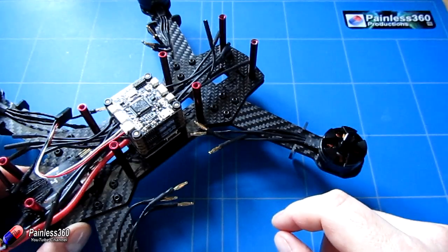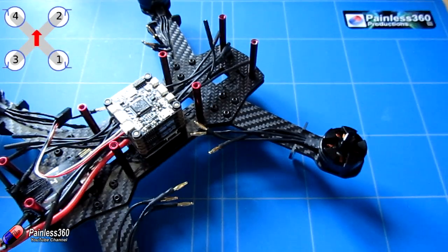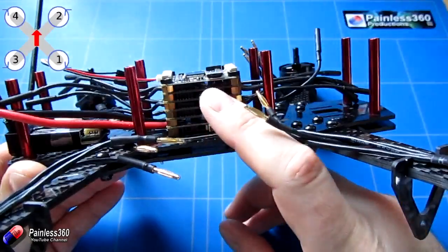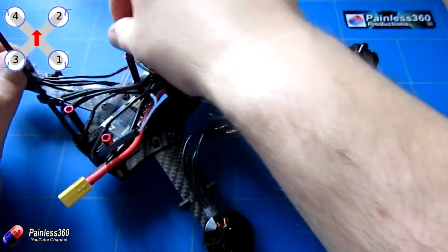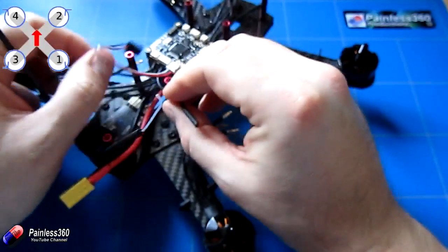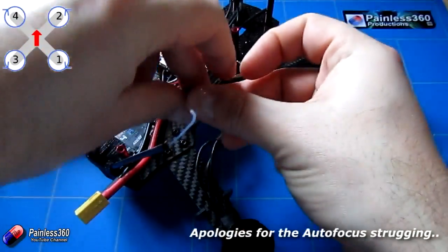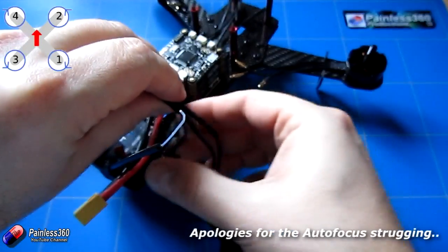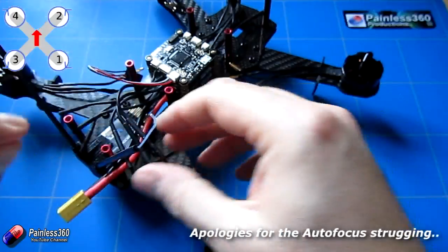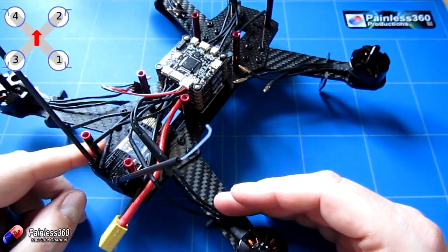It's helpful to have a little diagram of how all these motor connections work, so let me pop this up in the top left corner. This is standard CleanFlight motor connections. The way the cube works is the top ESC is number one, and motor one is this rear one here. We get the three leads coming out of the top of ESC one and plug them into the three wires from the motor — it doesn't matter which way around. If the motor is turning the wrong way, we can change it. So that is our first motor done.